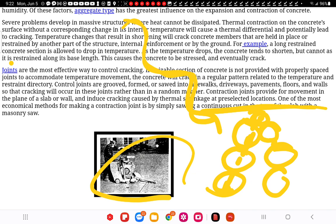All right, you also have the temperature of the soil below, it's acting as a thermal shock also, and you get your fractures of the weird nature. A lot of times people see this curling of concrete with that thermal, quote, shock from underneath.